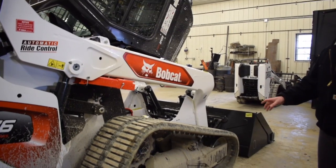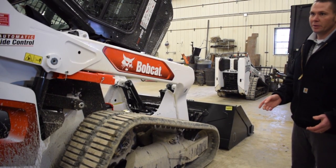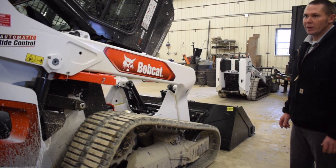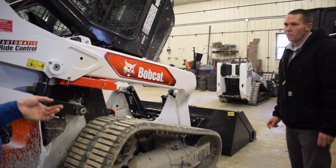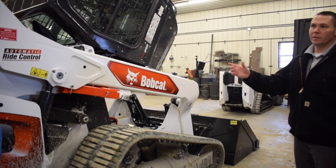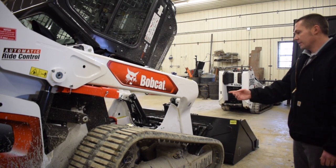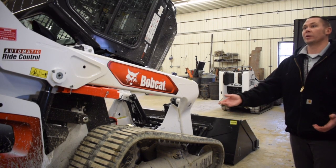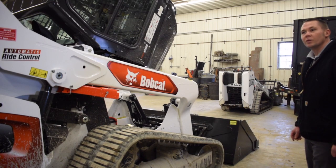The track frame on this one has the torsion suspension. Having the fifth linkage point gives you a ride quality like what Cat has, but without the porpoising that tries to throw you out of the seat when you stop quick or have a heavy load. It's better for grading, though the solid undercarriage is still an option. The tracks on this machine are a factory option — the C-pattern like the old machines had is the other option, so you can pick whichever you want. This came about by popular demand as guys replaced their tracks and just wanted those same tracks on their new machine.